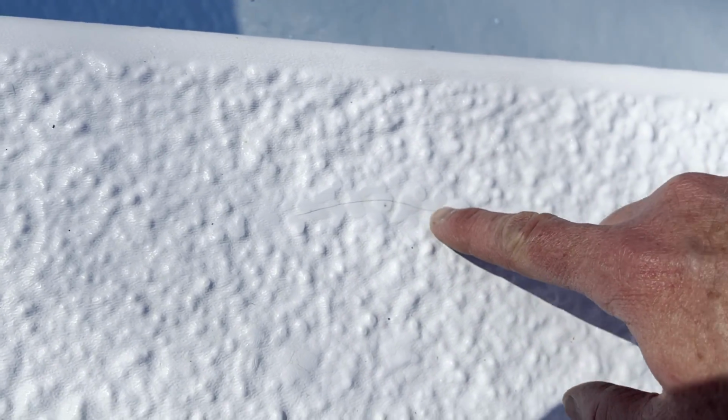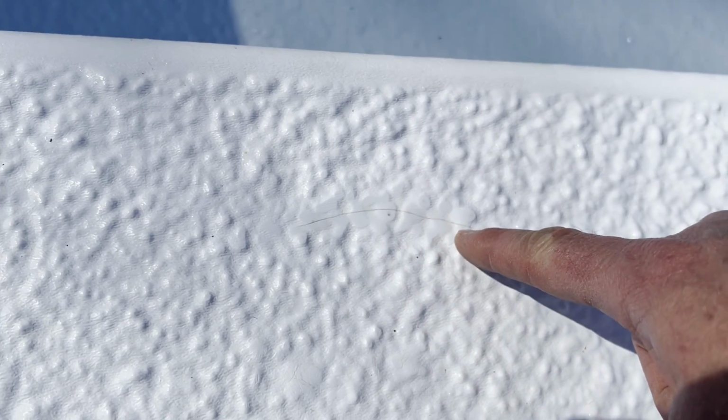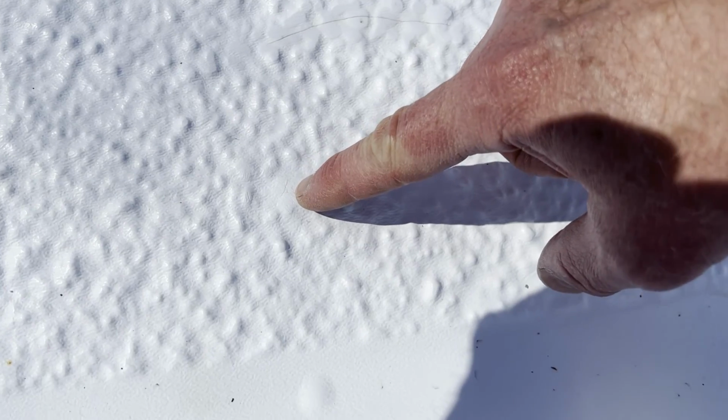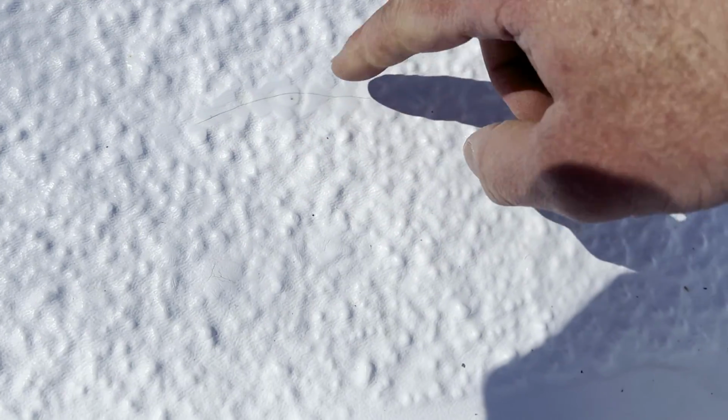I'm going to try to do some cosmetic repair on my steps for the pool. I got this hairline crack here, but I don't think it's leaking or anything, but I'm going to epoxy it, and there's little cracks like here. And there was another one somewhere over here. I sanded them down so it's harder to see. I sanded them with 80 grit and then 120, and then I'm going to clean it with alcohol.